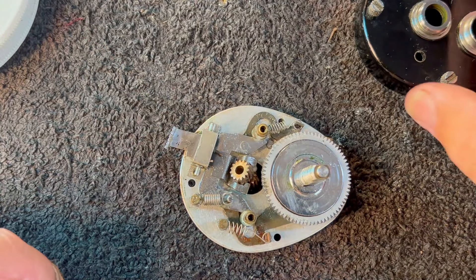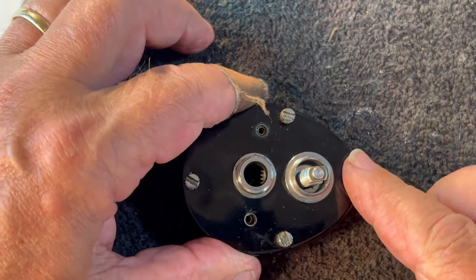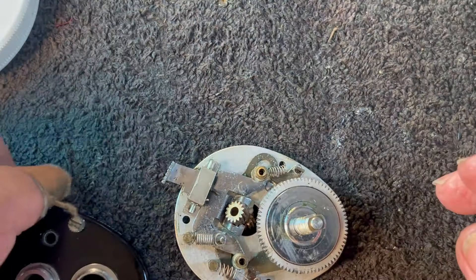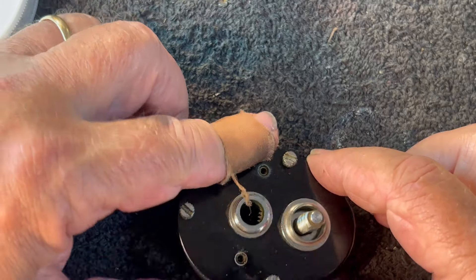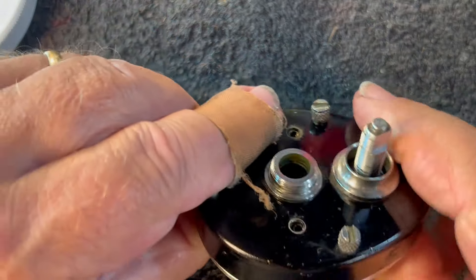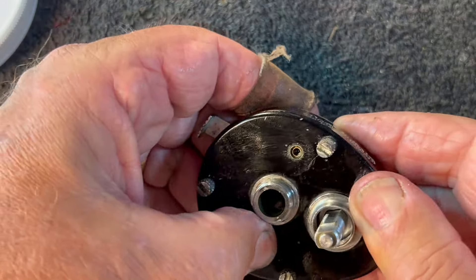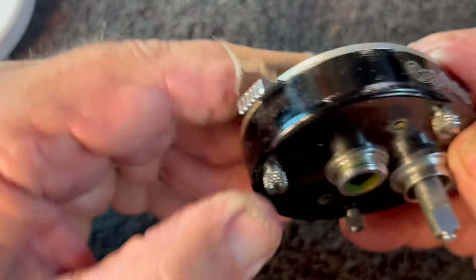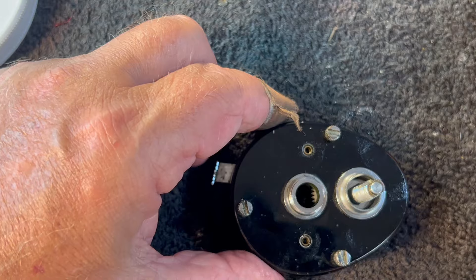Oh we're missing a piece — sorry guys. Going to lift this back up for a second and we have to install this washer, then it goes on the gear, and then goes on your other dome washer like so. So far that all looks pretty good. We're not going to get that to stand up without putting the rest of it in, so let's go ahead and set this in place. Push that anti-reverse in a little bit, set this back in place, and it's going to fit down through the cover like that, which should make this fit closed. Make sure that this lever is in the hole like so, and we can put these two screws back in.